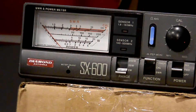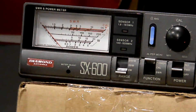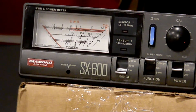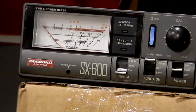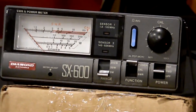Radio six does just under three watts — almost identical to the antenna versus the dummy load. This Bird model 8201, 50 ohms, handles 500 watts — it's a beautiful dummy load I have for my HF rig. So now you know there's no difference between a dummy load and a real-life antenna — maybe because my SWR is so low. It's almost exactly the same. All right, take care guys, and I hope this satisfies the people who required a dummy load test. Cheers.